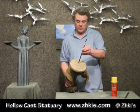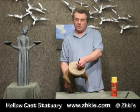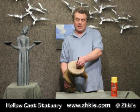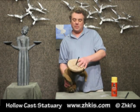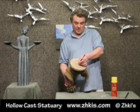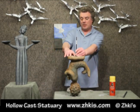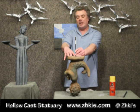Poke the straw all the way up as far as you can and just blast away — it will eventually start to ooze out. As it starts to do that, insert your rod about three inches up into the piece and turn it a little bit to get it to adhere well to the rod. Over the course of the next hour or so, the foam is going to try to push the rebar out. Come back every 15-20 minutes and push it back in, or take duct tape to hold it in place. Make sure the rebar hasn't gone off to an angle — reposition it so it's straight up and down. After about 24 hours, the foam will harden enough to be trimmed off. Take a utility knife and trim it, then put some caulking or paint around that edge to keep it watertight.